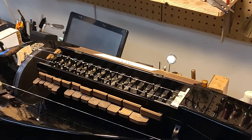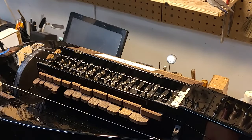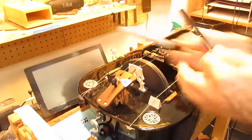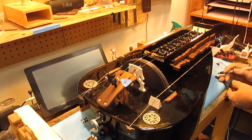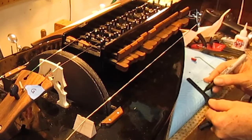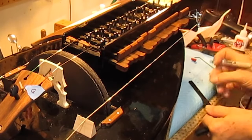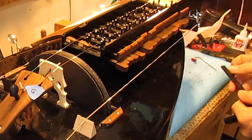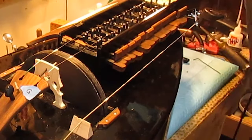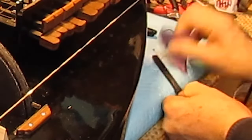Still a little bit of a high spot where the wood is raised up, so I'm going to trim that back — nice and flat. A little bit of color, even though it's on the underside and no one will see it, just an aesthetic thing. Rub that in, blend it in. Still a little bit of evidence of a crack there, so I'm going to fill that too. Let's sand it just a little bit to clean it up — 400 grit paper, nothing too extreme. Now I know that bar will slide nicely and smoothly in and out of its slot.